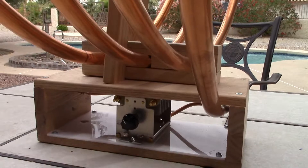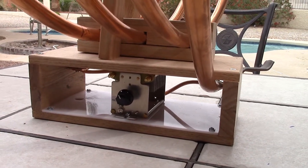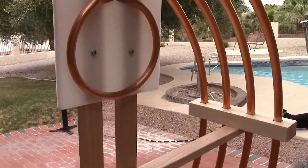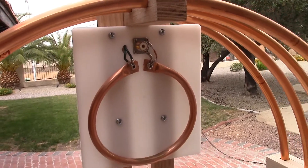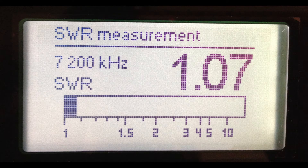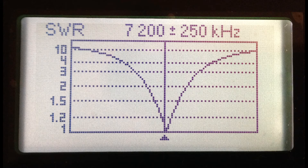Here's the finished product, and it's worked pretty well. The last thing I did was put the capacitor on it, which is located there at the bottom, and of course the driving loop, which is a smaller diameter loop of just one turn. The SWR has turned out really well — when it's tuned properly I can get near a 1-to-1 match. Of course, this type of antenna has a very high Q, which means if it's tuned off frequency just a little bit, the capacitor has to be adjusted.